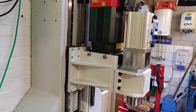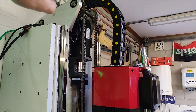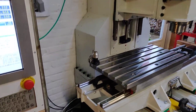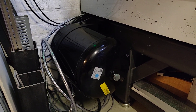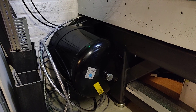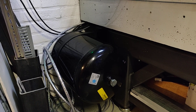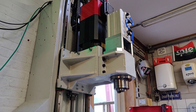The head has a pneumatic counterweight. There are two chains that go over the column and down the back side, where there is a big pneumatic air cylinder connected to an air tank. This air tank is about ten times bigger than the cylinder capacity, so every time the cylinder moves in or out the pressure rise isn't that high, and the force of the counterweight is more or less always the same.